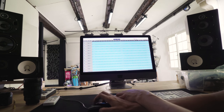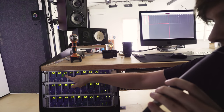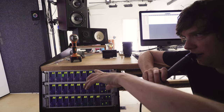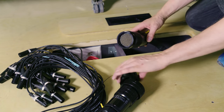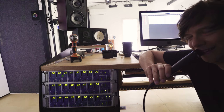Let's go back and try again, see what happened there. Channel 3 is not working from the machine. I connect myself directly into the preamp and now everything is healthy. Everything after the boa constrictor is healthy. Somewhere in the big cable we have an issue on channel 3. I'm gonna talk to Christoph to see what he thinks I should look at first. It can be in kind of a lot of places.